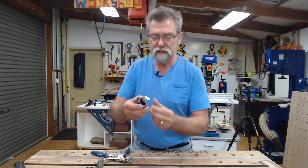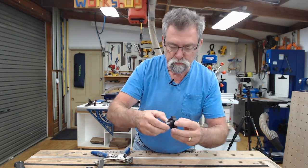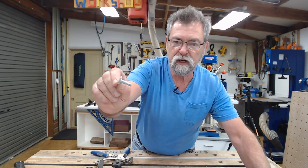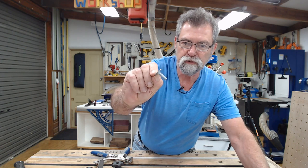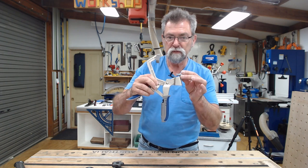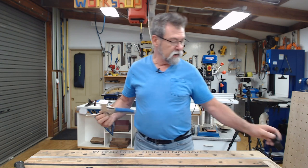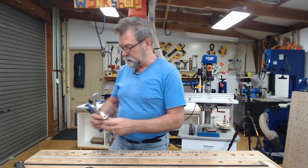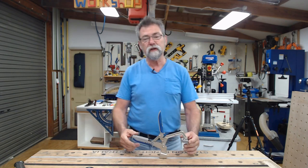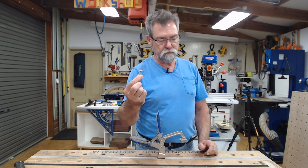Now, I take it out and I put a 1-inch by 5/16 T-bolt instead. So this is a little T-bolt with a plastic handle on it. We'll take that captured nut out of off there, and that's the guy that I've got. That's what I use. And he goes into there, fits perfectly in the hole because it's the same thread, and that allows me to use it in the T-track, the quarter inch T-track, really, really well.